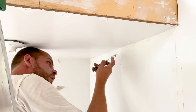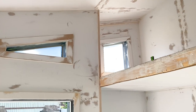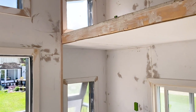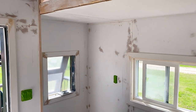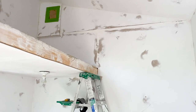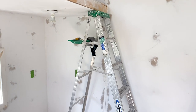It worked out well because the tile and hardboard ended up almost at the same level, which looks really sharp. To finish the hardboard we filled all the staple holes with drywall putty and used caulking on all the seams, which looked really nice. We let it set, gave it a sand, and once everything was sanded we were ready to paint.